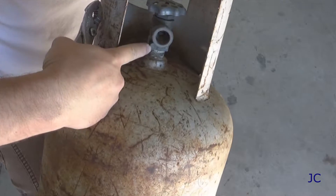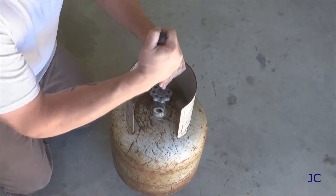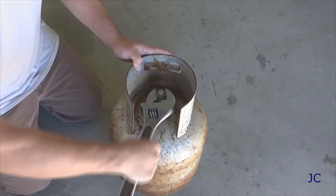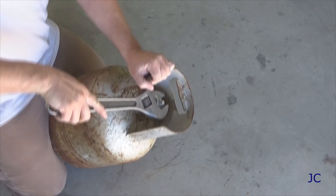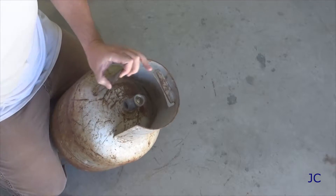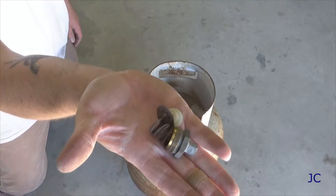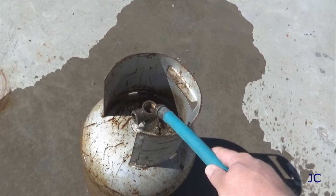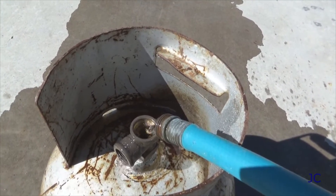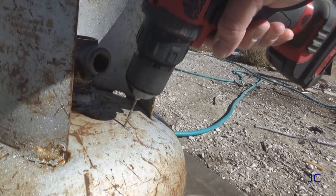The first thing we need to do with this project is remove the bleeder valve from the propane tank's main valve body. This way we can make sure that there isn't any propane left in the tank under pressure. Once you have the bleeder valve out and have established that the propane tank is in fact empty, you wanna take the handle off of the main valve. This will give you access to the nut that holds the valve internals in place. Break that loose and unscrew it from the valve body, then remove all of the internal valve components. The reason we wanna take the components out of the valve is so we can fill this tank full of water to displace any propane that might be left in there, so we don't have an explosion or fire hazard when we go to start welding and drilling on this thing.